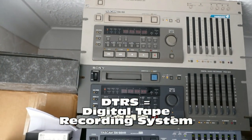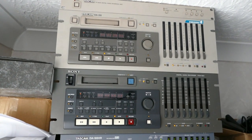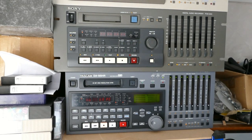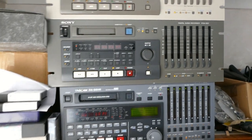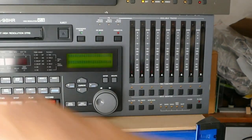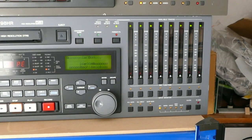Finally, we have a professional multi-track digital audio format called DTRS. Clearly Sony and Tascam worked together on this format, since the two machines are strikingly similar. We're going to demonstrate using a slightly later version of the format which supports more bit depth — up to 24-bit high-resolution digital audio recordings of up to 8 channels, and permits dubbing of any channel independently. The first thing you have to see is what the VU meters do at switch-on; stand back and squint at it — you see the words 'Tascam HR' scroll through the LEDs. Someone must have got a bonus for that.